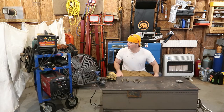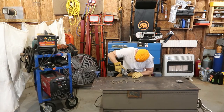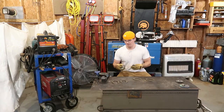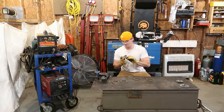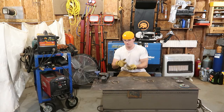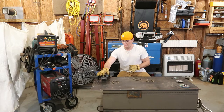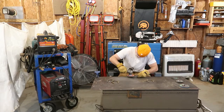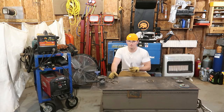So we're going to move on and get these things clean. What you may find on most of my videos is the favorite thing on the grinder is going to be the cut wheel — you can grind and cut, so it's multi-purpose, and that's basically what I like to keep up there. For the first part it worked fine, but having to do these little skinny edges just wasn't cutting. It was going to take forever, so I switched over to the flat disc. Just like that, quick and easy — did exactly what I wanted to. That flat wheel is so much better.